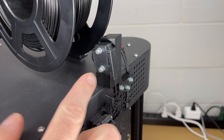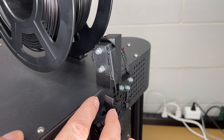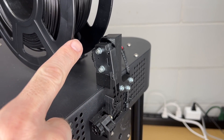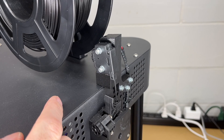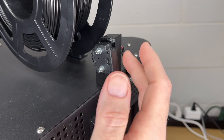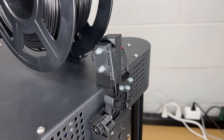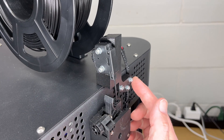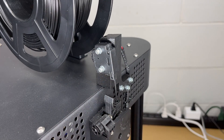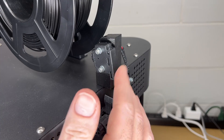So that was installing a broken filament detector on an FLSUN Q5 3D printer. I have a lot of 3D prints ahead of me for a project, so I'll be going through quite a bit of filament. Having this broken filament detector will allow me to finish off the rolls — it'll sound an alarm so I can come and replace the roll and continue printing. This was a mostly easy install if you're familiar working with tools. You do have to 3D print the bracket, and there are other bracket designs. You'll need to find some mounting hardware, but you could probably just zip tie it — pass the zip tie through one side, out the other, and tighten it really tight. And that would probably hold it just fine. On my other 3D printer this thing's flopping in the wind and it works well that way. You just don't want it falling off and binding up.